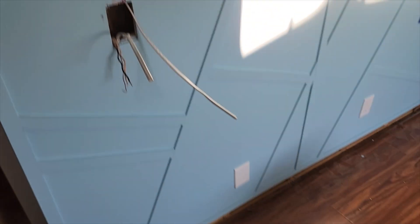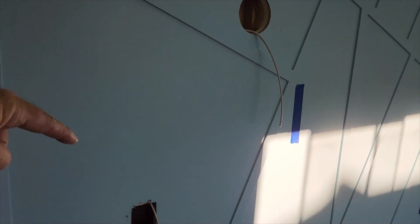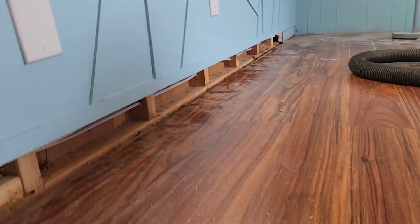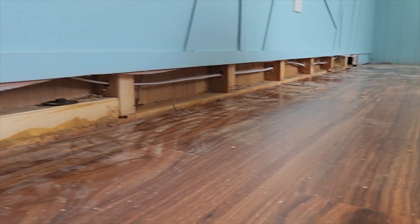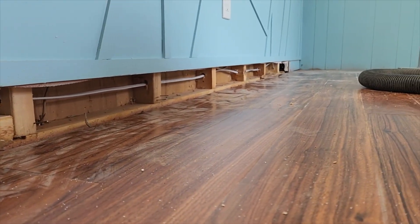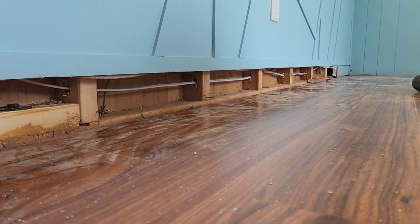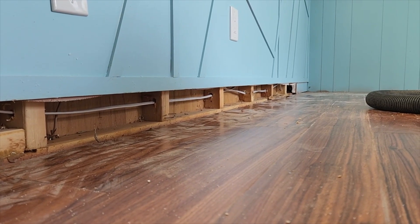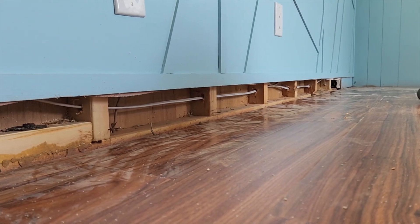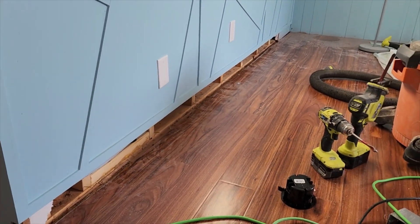Next day: I pulled the switch box out, cut the hole, and ran a wire from that hole down to this switch box. Then I used the behind-the-baseboard trick — I did a better job here and it was much easier to drill. You can see how that line sits in there. I put it in the middle so when I put a brad nail in, I'll hit below and hopefully above it without hitting the wire. I'll use short brad nails since I only have to go through a little bit of paneling. Let's get these boxes wired in — unfortunately the light fixtures won't be here for a couple more days.